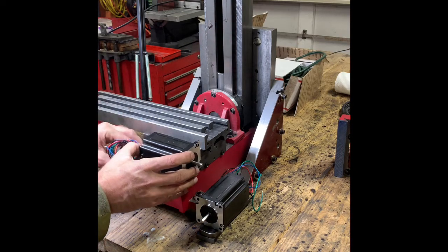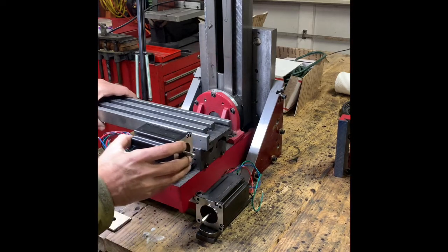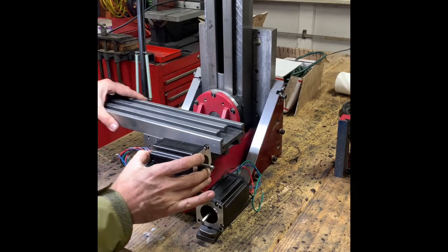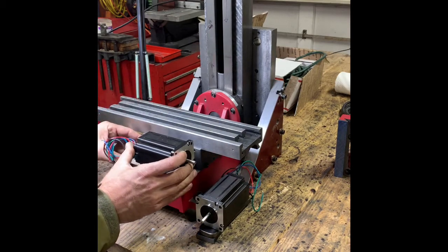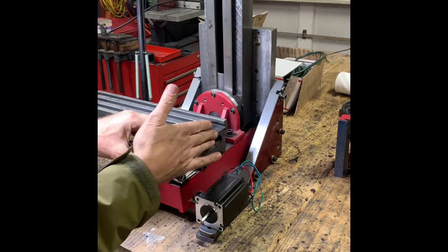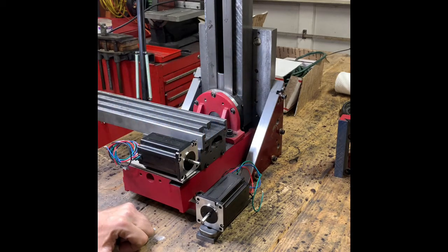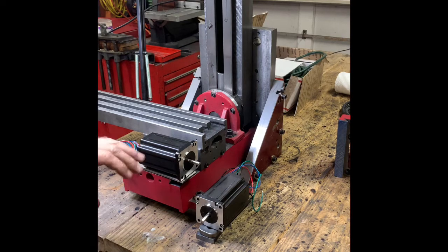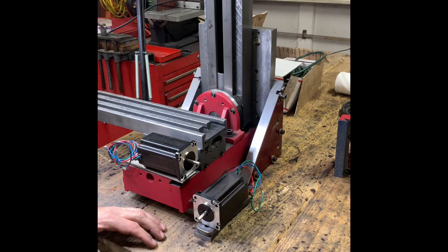I think I have a configuration I kind of like right now. This motor — these are just some spacers — but this motor would be sitting right here and would go back and forth like this. It clears the one below it because when the table's over here, this one moves with the table. I got a couple parallels in there, and there would be a plate that mounts here. I'm choosing to do pulleys to drive this instead of direct drive. There are some advantages to that, including being able to reposition the motors.